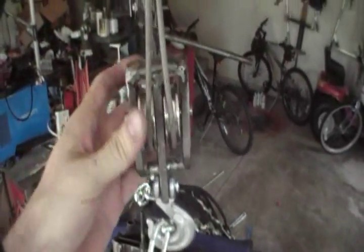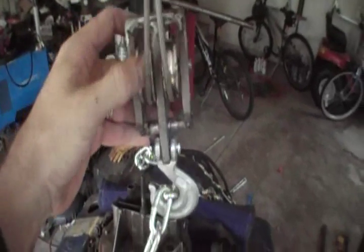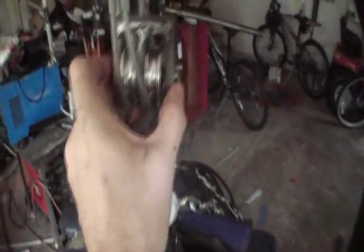I figured I'd take a block and tackle. I tried an old wooden block and tackle first, but I wasn't comfortable with how that was handling itself. So I bought some $3 pulleys rated at 250 pounds each, took the little rollers out of them, drilled them out, had a pin, and then I made this block and tackle setup on the end of my cherry picker.